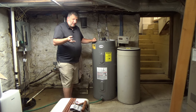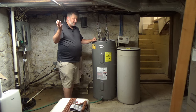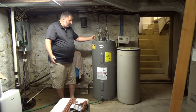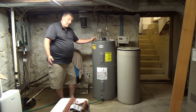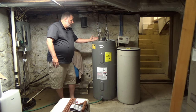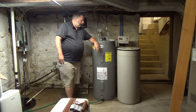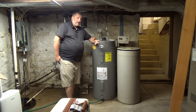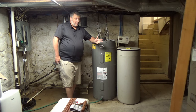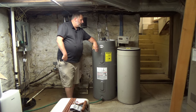On this channel we're not going to do that — we're just going to fix stuff as they are. We're not going to get into why something failed; there are other channels for that. So: 40-gallon water heater with an anode rod, paid $118 at the time, going on about a year ago. I'm 11 months in and I really haven't seen any negative or positive effects. I think the real positive effect was taking the magnesium anode rod out — that got rid of the sulfur smell.